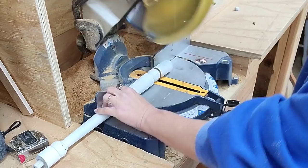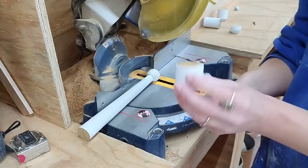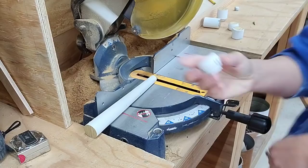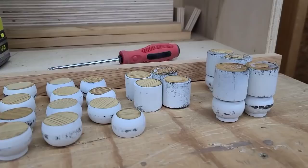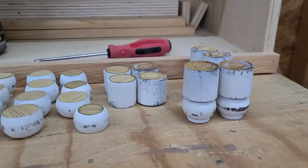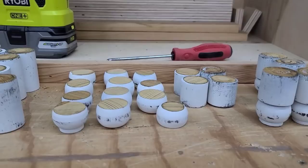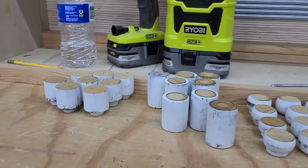Next I'm going to cut the spindles down. Now these are the spindles she gave me — this is not what I normally use. When I cut spindles I try to find a common area on each one to cut down so they end up being the same size, using all the little natural stops it already has. What I ended up with — these spindles must have been hand-turned because almost none of them ended up being the same height. This is definitely not a spindle I would recommend. Honestly this is something I'm not going to do again — I kind of just said yes not knowing what I was getting into, didn't ask enough questions. It ended up working out, I made do with what I had, but this was probably an order I should have passed on.